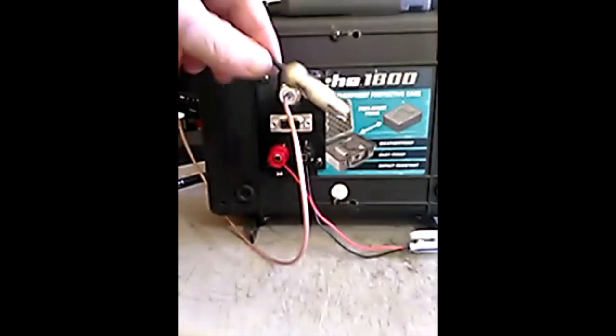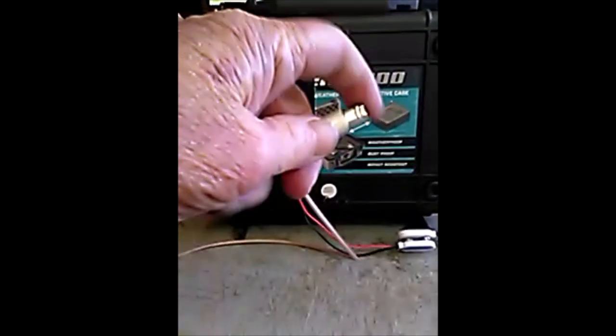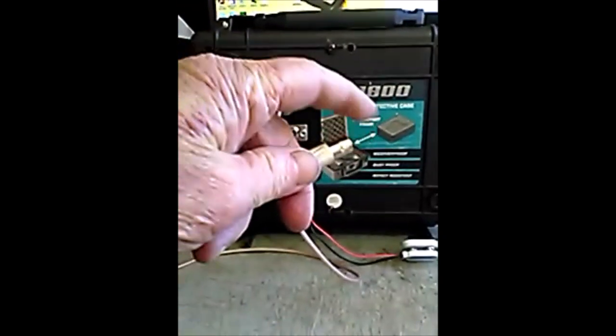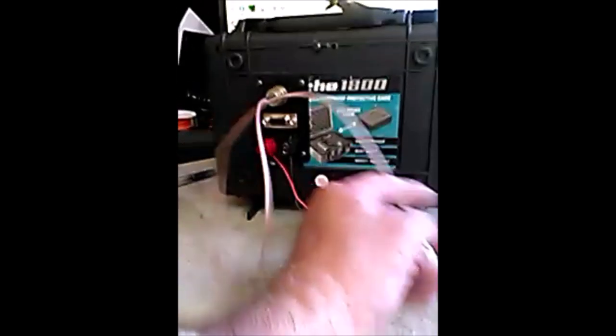Here's the cable with the BNC installed on the display unit back side. The other end will mate with the cable coming down from the antenna. The reason I did this is to provide two feet of flexible cable so the unit's location won't be dragged around by the mass of the main antenna cable — giving you flexibility as to where you want to install the display unit.